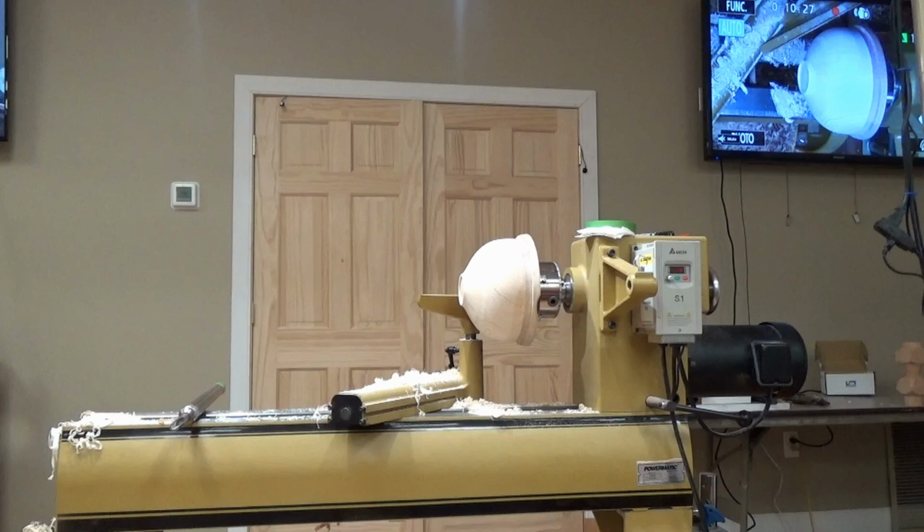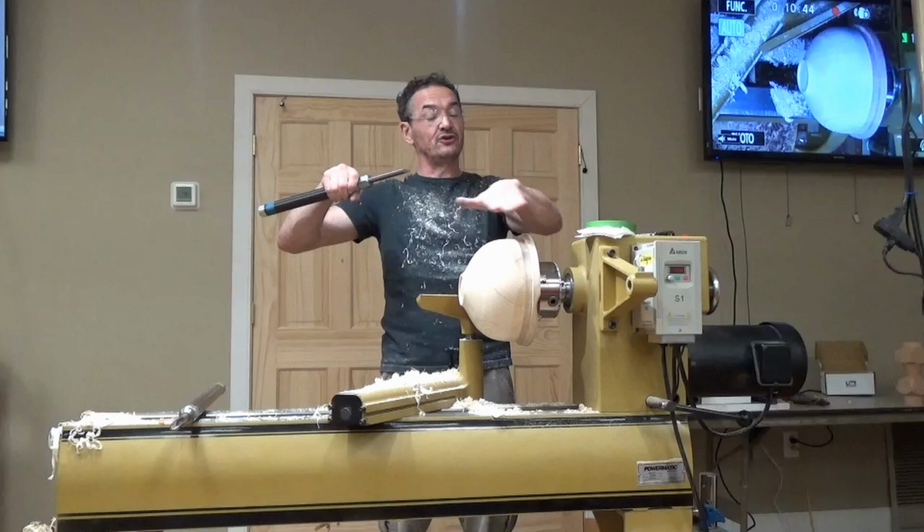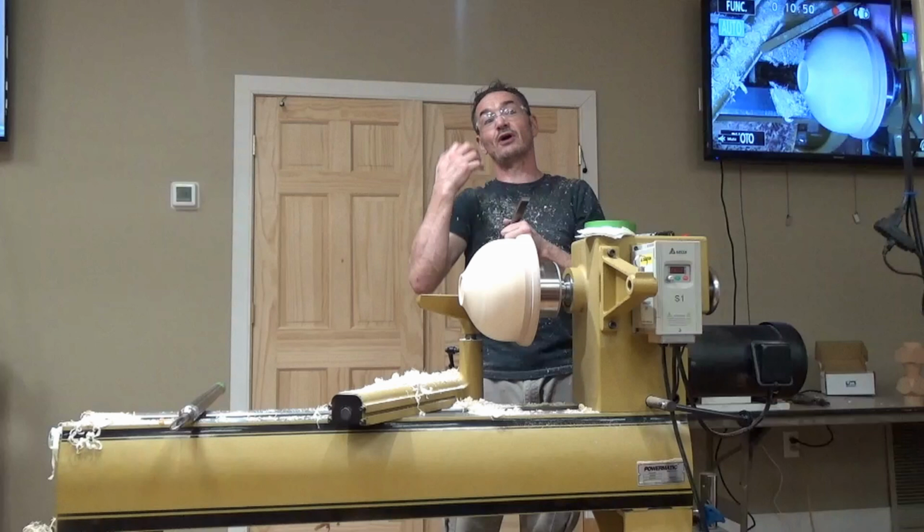It's the grabbing we can't cope with. That's what blows up the piece. That's what makes it tear the grain, because it's attracted to the end grain. So it goes, oh, end grain, I'm going to grab some over here, and the next thing you know, it's blown up the hole. So it's all to do with preventing the grab. That's what negative rake scraping does, it prevents the grab.